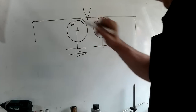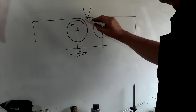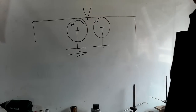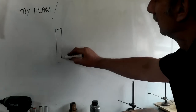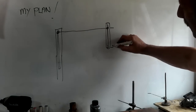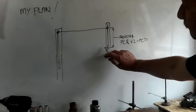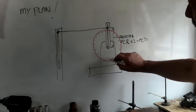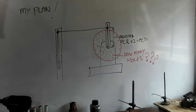All but one I've seen on YouTube employ a strong wire supported by a fixed point at each end. It's wound over a set PCD roller that in turn manipulates a gear blank under a cutter, producing a gear tooth shape. My idea is to use a solid bar as a push-pull link to rotate the gear blank about its axis. This bar is to be connected to one fixed point on the shaper, the other end connected to an adjustable PCD index arm, indirectly connected to the gear blank rotation shaft via an index plate.